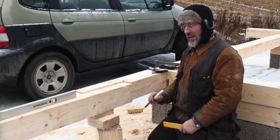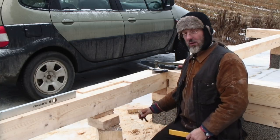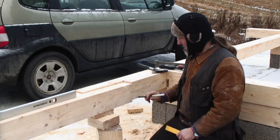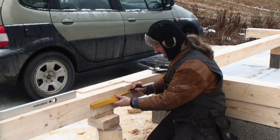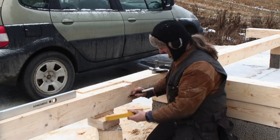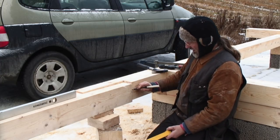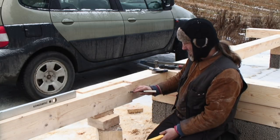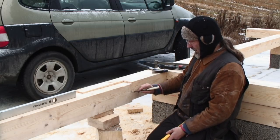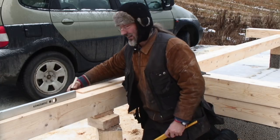But now today I've decided, well, I thought there was going to be a wind brace, but maybe there won't be a wind brace. In the absence of that, what I've decided to do here is put a 5 centimeter tenon here and make a mortise in this wood at that point. Well, actually, I might put it at the top. No, it has to be in the middle. So I'll mortise that into a tenon, the tenon into a mortise, and the same thing on the other side.